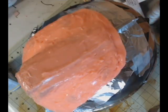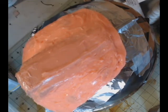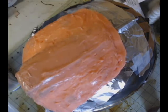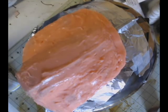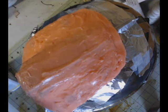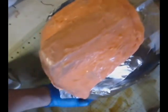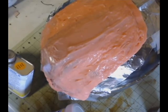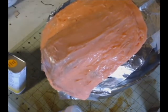All right, so I ended up having to cover those plastiline registration keys with foil to get them to stay. They wanted to keep falling off, so it wasn't a big deal, but I did go ahead and cover them with foil, get them added back on, and they worked pretty well. So now we're going to move on to making our mother mold out of Plasti-Paste.